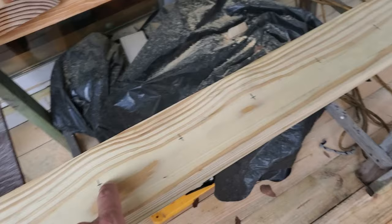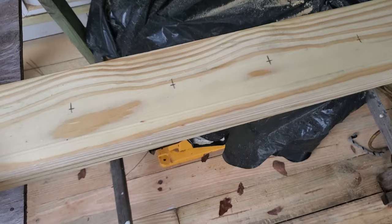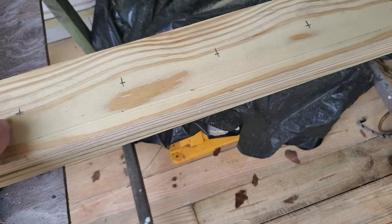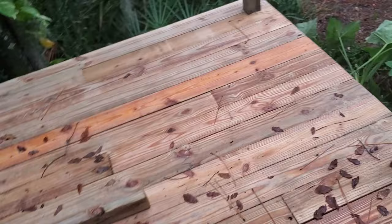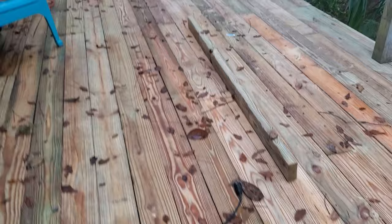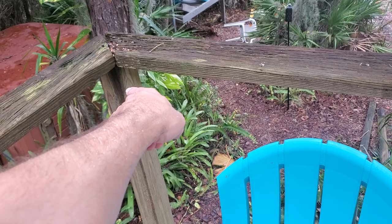The first thing I'm doing is cutting myself a little storyboard. I'm going to drill pilot holes every four inches, which is the code — you can't pass a four-inch sphere through your balusters. With this being four-inch on center and a half-inch conduit, that leaves a three-and-a-half-inch opening in between each rung. I'm running these horizontal to match the run of the deck boards, and the skirting is all horizontal too, so it should look pretty good. My plan is to do about one to one-and-a-half inch deep holes on the ends and through-holes in the middle.